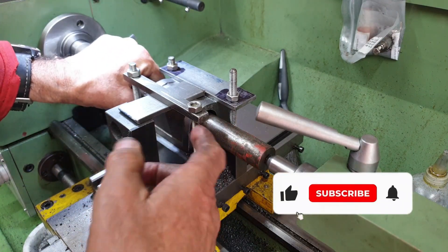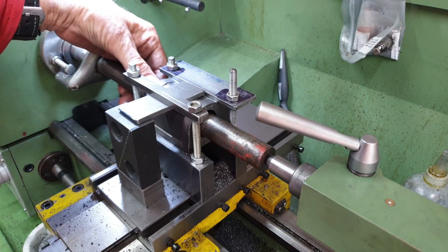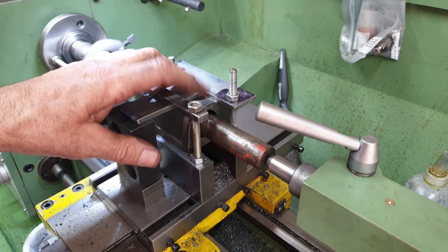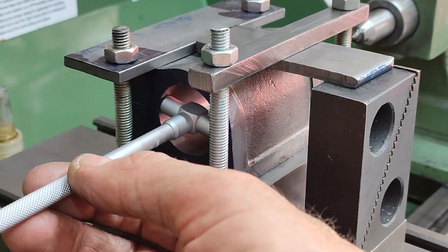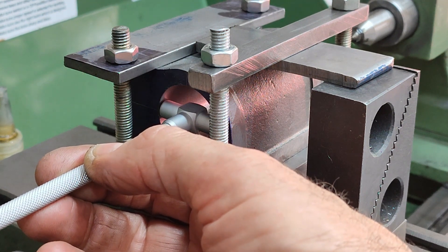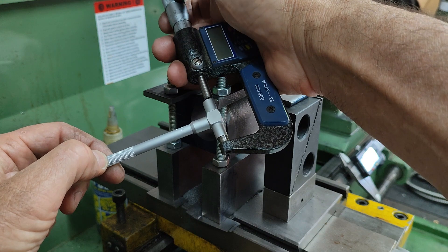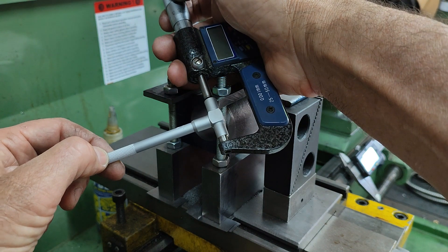Once the bore was completely circular all the way through and I'd opened up to round about 31mm diameter, I stopped and put in my larger boring bar — a 25mm diameter bar — which should give me a little bit more rigidity for the final cuts and makes it much easier to make fine adjustments to the depth of cut. To measure the bore I am using a telescopic bore gauge. By taking multiple readings each time I come to a consensus as to what I think the bore is, give or take plus or minus 0.02mm. The LCD display on this micrometer doesn't work so I'm actually taking the readings off the barrel.